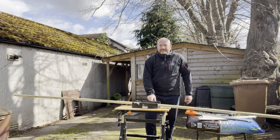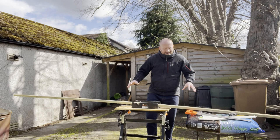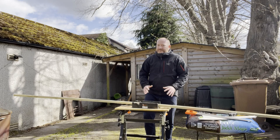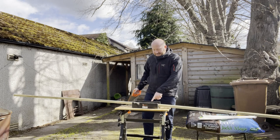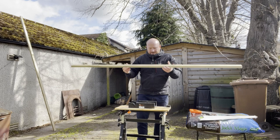I've measured out two metres here and I'm going to make my first cut. The reason I'm cutting the two-metre section first rather than cutting into smaller pieces straight away is that it makes it easier to manage — a 4.8-metre length is really cumbersome to deal with. Cutting it near enough in half makes it a lot easier. So I've already got my first measurement marked at two metres — I'll put the cut in and be back with you in just a minute.